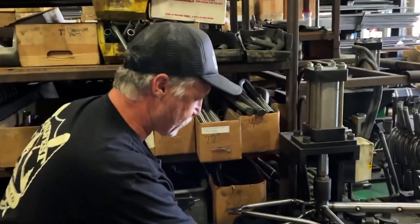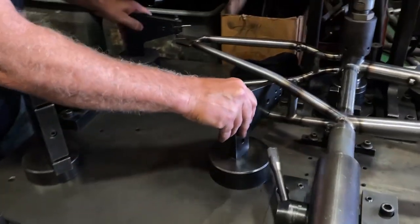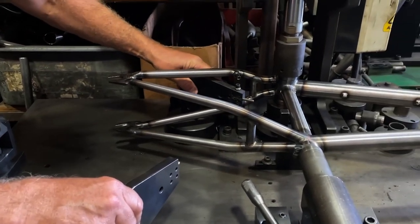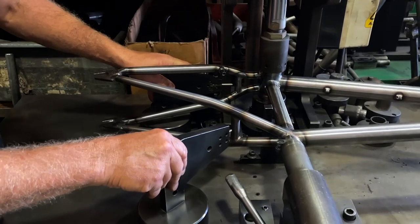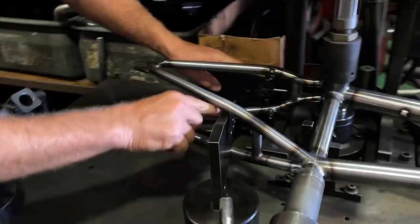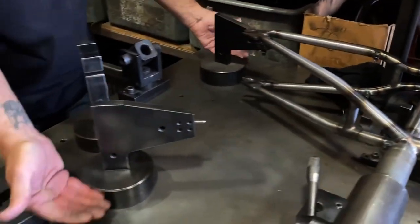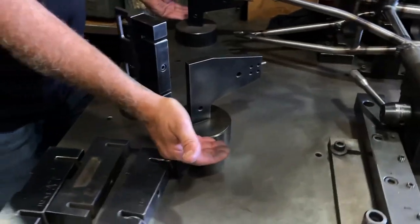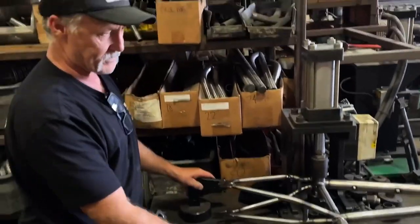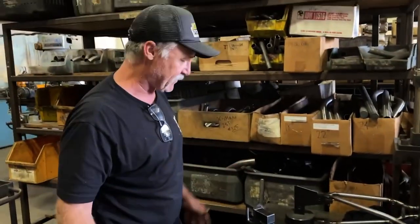Then we've got some other tools that we use — these tapered tools so that you know that the frame is perfectly symmetrical. You can check your center lines with these indicators. You can also make contact with the seat stays or chain stays at different points, and again, everything is measured to come off the table. So the center line is the same as the rest of the frame. That's a real quick overview of how we determined that the frames are perfectly straight.